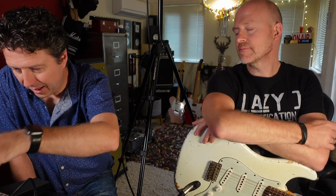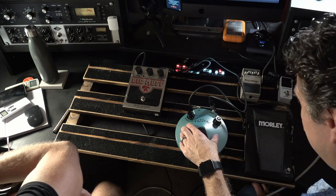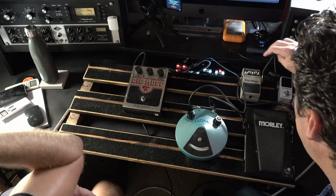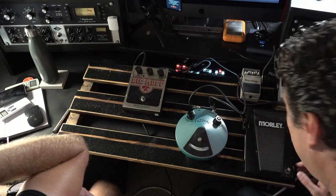It doesn't like that, does it? Now we've got the problem — the wah is feeding the fuzz. We're now going polytune, EQ, wah, wah into fuzz, fuzz into muff. If I wanted to send Morse code it'd be great. That is the classic case of an impedance mismatch between the output of the wah and the input of the fuzz. Nasty. Now there's an interesting argument: why not put the fuzz on the other side of the wah? So basically, run the fuzz face into the wah, and then the wah out into the Big Muff.